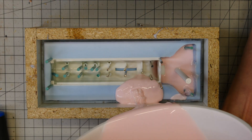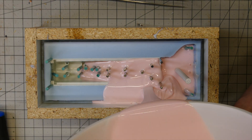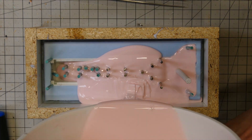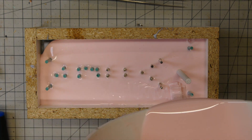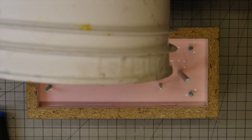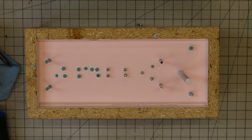Try to pour from one location and let the silicone flow out so it basically pushes the air out of the way and reduces the chance of having any trapped air inside your mold. You did all this work — you don't want to trap the air. Let it cure overnight and we should have a nice two-part mold.